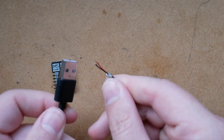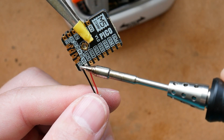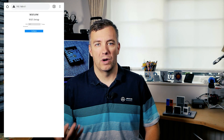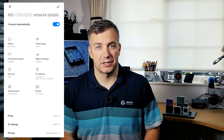The easiest way to get started with M5 Stamp is to take a sacrificial USB cable — I've chopped it off — and use the positive and negative wires to provide 5 volts to the corresponding pins. Once you power it on, that's pretty much it, because the board comes pre-flashed and will create an access point. Before you connect to this access point, just take note of it, because everything after 'M5-' is your API key to use with UI Flow. Note it down because you're going to use it in a moment.